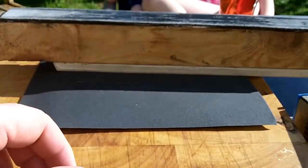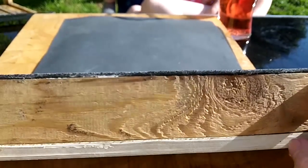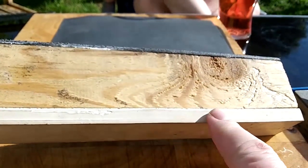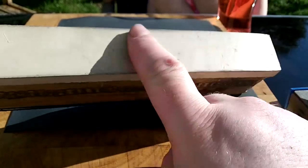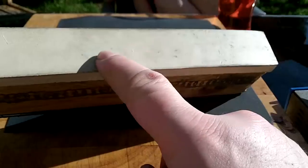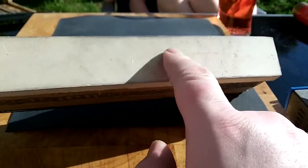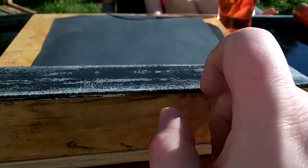When you finish with your gritted stones, do a bit of stropping. This is an old leather belt glued onto a piece of durable lat. The rubber on the backside is for convex honing — there's a slight give in the rubber, so it'll convex an edge fairly handily. You can also stick sandpaper onto that and walk up through the grits until you reach the end.